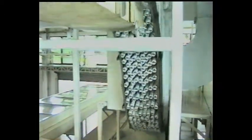When sufficient cans are detected on the infeed conveyor, individual case blanks are removed from the horizontal magazine and set up U-shaped between moving flight blocks on the main flight chains. An adjustable plow then closes the top panel and minor flaps, where the glue guns apply hot melt glue. The major flaps are then sealed by top and side compression belts before the cases are discharged.